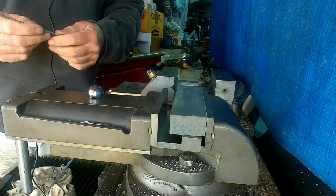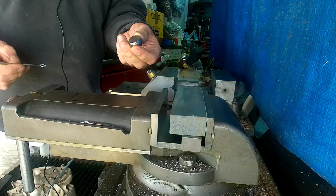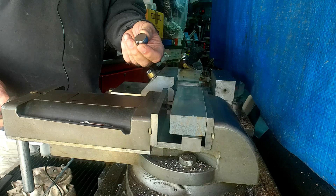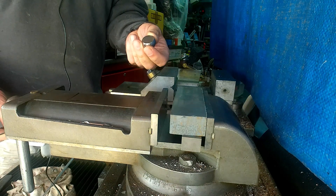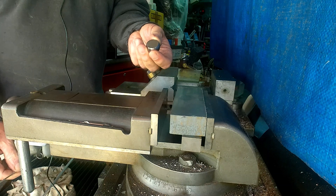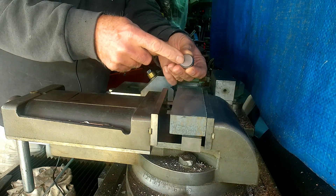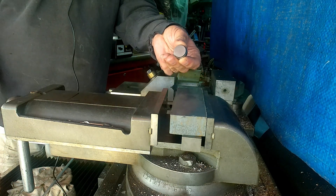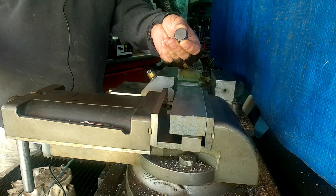These balls can be turned on a lathe with a carbide tool. Machine it to the best surface finish you can get, then just rub it on a surface plate or something flat with a bit of wet-and-dry to get a nice flat finish. And there we are — another little tip for your brain for future use.